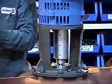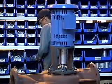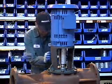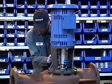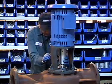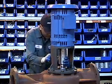After doing that, he's going to put the other side of the coupling on. Then he's going to check the shop order again to make sure the screws that he's going to insert in the coupling are correct. After putting the screw in the coupling, Nalich is going to tighten to make sure both sides of the coupling are equal. Now he's checking to see if it's equal.